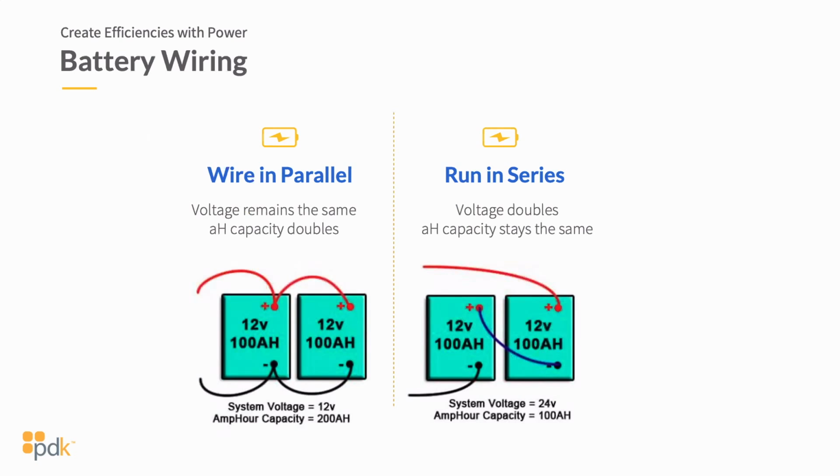It's not going to affect your hardware, but it's going to affect your total amount of battery backup time that you have. So when you're running a 5 amp hour battery, you may commit to your customer, hey, we're going to give you 1 hour of battery backup, and you put in a 5 amp hour battery and you're pulling 5 amps of continuous duty. Number one, you're going to decrease that based on your inrush, so every time that unlocks and locks up, but also you're going to decrease it because that battery, over the life of the battery, will start to decrease, and you can get down to 50, 25, and then eventually 0% functionality there.